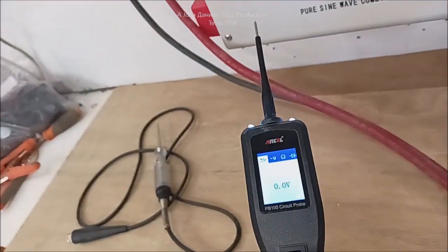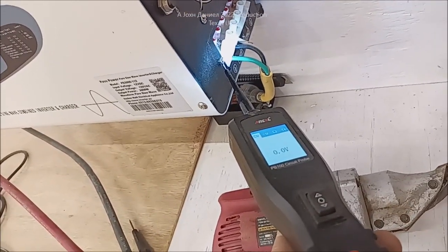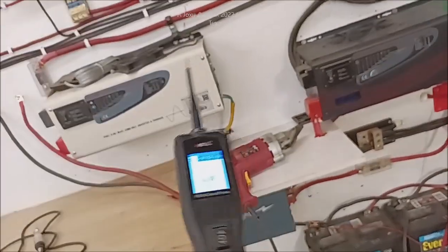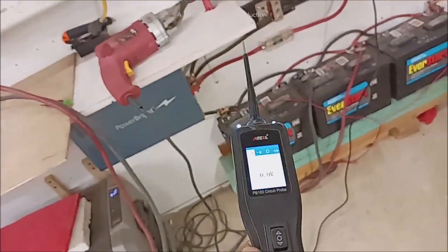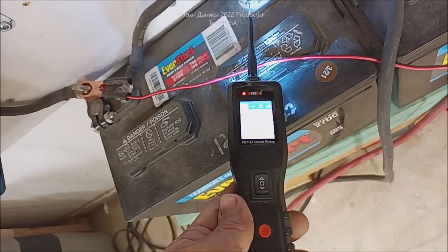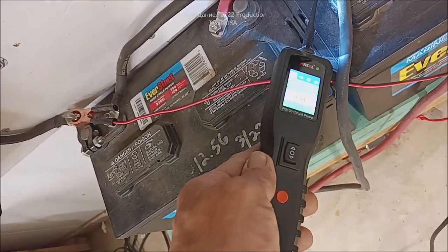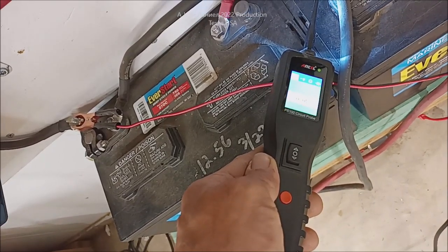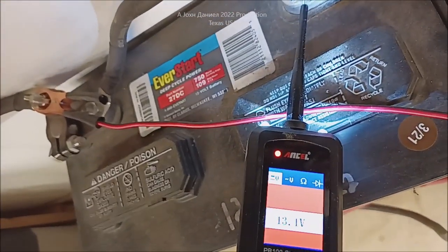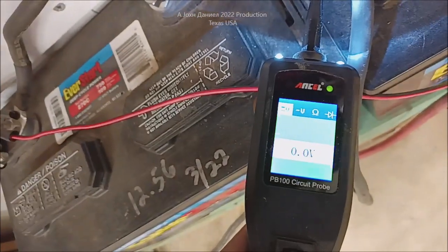This thing goes up to 100 volts DC. If you want to know whether you've done a circuit correctly, this is how you do it. You'll also know whether you've got a DC ground where you should have an AC common or AC ground — you want to keep them separate, because you'll build up a load of static in these things and kill them. The other thing is, to find out which battery lead is which, you can check the pulse sound — consistent beeps tell you positive from negative. Even in the dark you can tell positive from negative just by the sound.